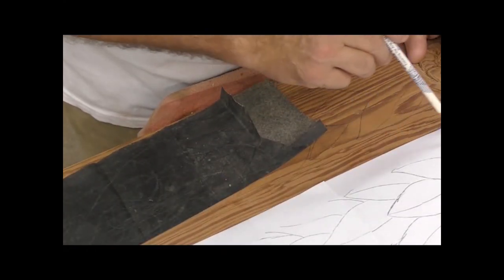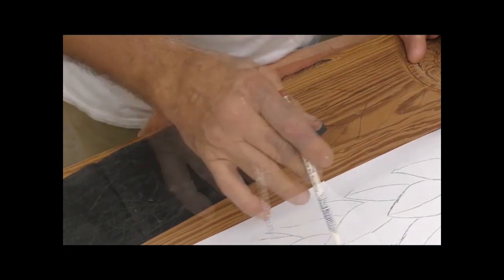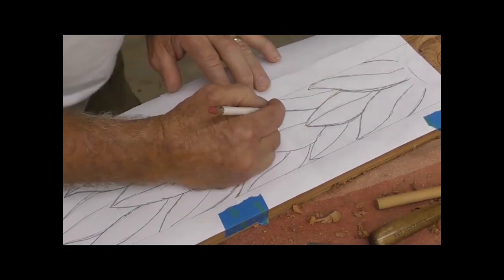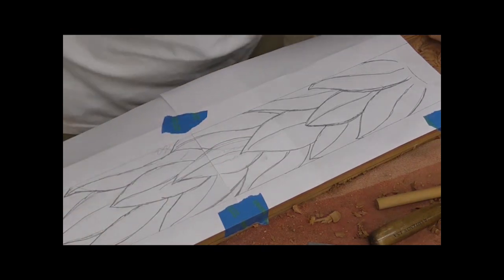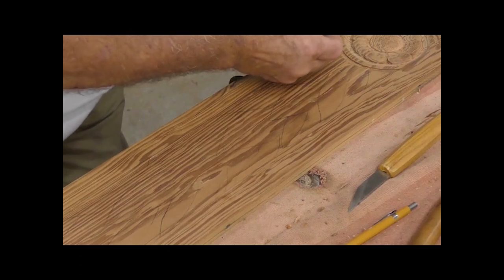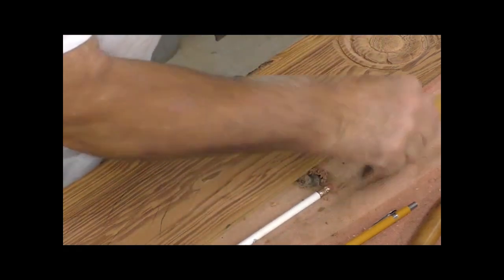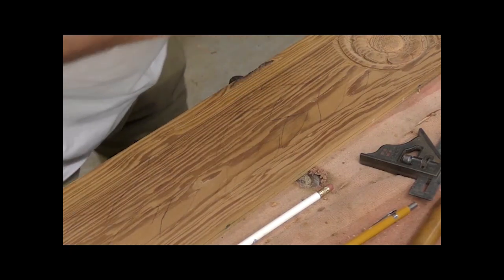Alright, so once I put my edge lines on this side with a ruler, then I have a pretty decent tracing to put on this left side of this carving. Pretty decent. There's a 1 1/8" border all the way down this, and all the carving tucks into that border, top and bottom, and from the finished end back this way is 1 1/8".